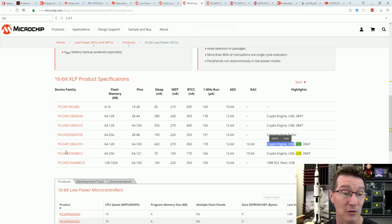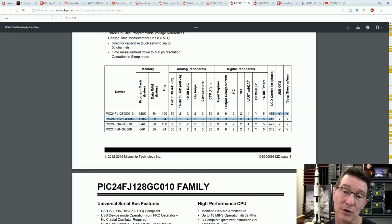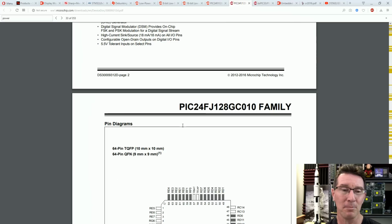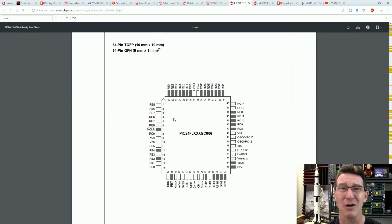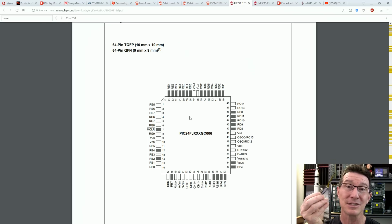And then if you go in and have a look at the bare minimum Microchip one with an LCD, liquid crystal display controller, these are like big chips, like 64K SRAM. Not only are they expensive, but they're quite large as well. I think the smallest package is like a 44 or a 64 pin TQFP or QFN. It's like, man, gross overkill. With this thing, it takes 2 microamps guaranteed in static mode, plus you can drive it with a 3-cent microcontroller. It's going to be hard to beat this, if cost is no object, of course.